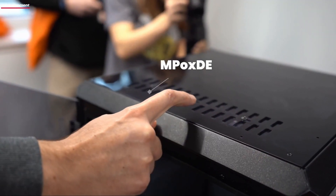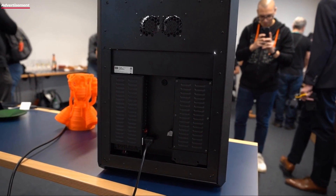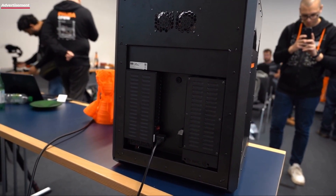There is a slider at the top to open a ventilation grid. There is active regulation of the build chamber temperature, and ventilation is built in at the back. In very warm environments — say 600 printers in a 45-degree room — the ventilation can't work miracles. The slider option allows the printer to print PLA and PETG in any environment even with the door closed. The printer was printing PLA with the door closed with no clogging issues at all, which indicates that the ventilation works well.